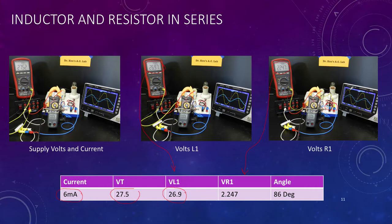If you look at the screen again, if I measure here to here, that's the difference. There, that's the difference between the blue wave and the yellow wave. And then if I measure from here to here on the yellow wave, could be the yellow wave or the blue wave, it doesn't matter because they've both got the same period. That distance there is the period. I'll just use a capital P to represent period.